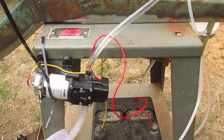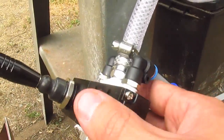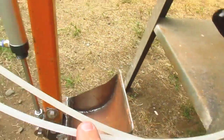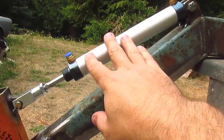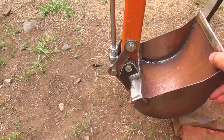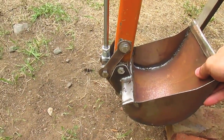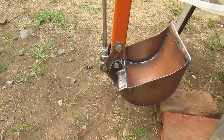It's got a pressure switch so when it reaches 100 PSI it shuts itself off. There's a high-pressure line going to a valve, return lines coming back to the tank, and control lines going to the cylinder. I've got this cylinder up here too but I don't have a second valve for it yet, so it's just floating and will move back and forth. This one has pressure to it and it's actually pretty solid — air is springy but this is definitely not, so if you put a lot of pressure on it it won't move at all.